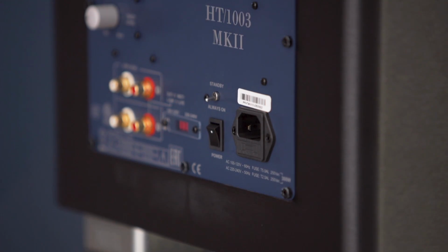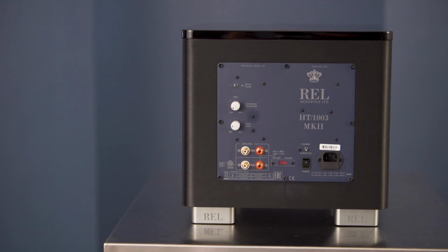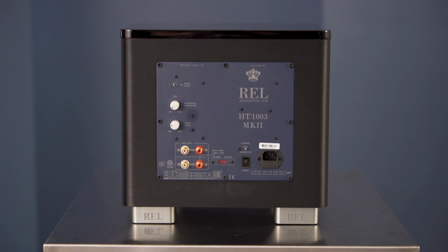The amplifier is a little, as I said, mini beast of a 300 watt monoblock. It's very high current. We upgraded everything in it. The thickness of the boards. We went to a tier 1 amplifier manufacturer to get everything done the way we wanted and are used to doing it. Boards are thicker, power supplies are much bigger, the regulators are tighter coupled, the quality of the coupling caps, all of those things. We looked at every little thing and upgraded every one of those items. This is a really big step up.